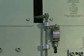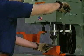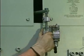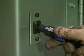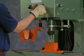Using the joystick control, raise the punch and place your work material on the die block. Lower the punch until you are a maximum of one-quarter inch above the work material. Depress the button on the lower limit switch button assembly and slide it until it rests against the bottom side of the limit switch — this sets the up stroke of the punch end. Both limit switch button assemblies may be turned on the limit switch rod for fine adjustment. Plug in the remote foot control, turn the setup/run selector switch to the run position, and the foot control off/on selector switch to the on position. The foot control allows machine use at maximum capacity.